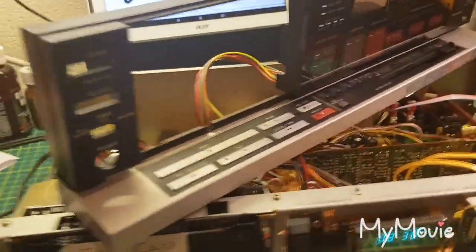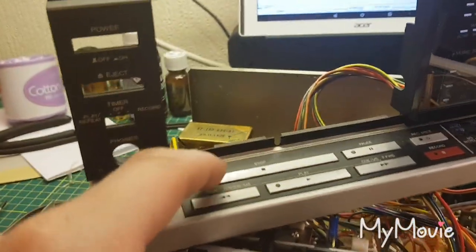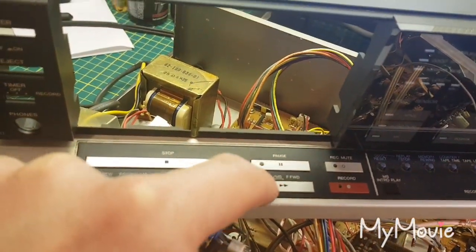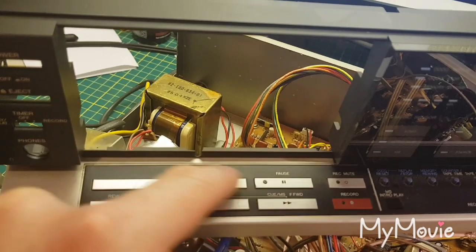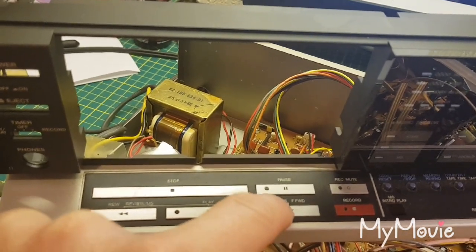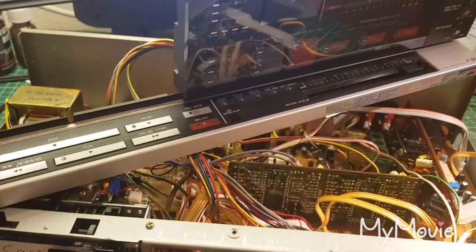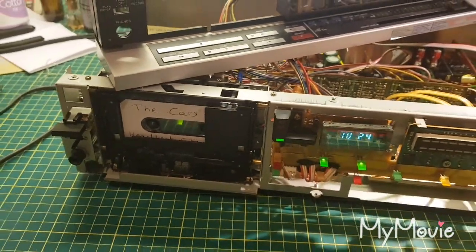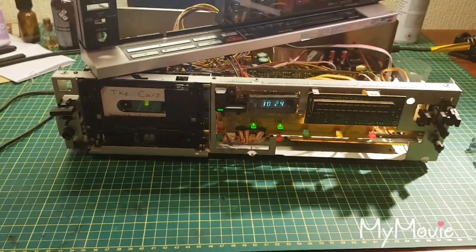The only thing I'm going to do is, once it's back together, remove the bottom panel there and look into these switches. I think the grease is probably dried up, because the fast forward doesn't pop up like the others. They've got a nice click, but it works, but it doesn't give you a nice click. So I think there's grease under there that's probably dried up. I'll re-grease the back of the capstan flywheels as well. So I'll be back when it's all back together. If you don't see this video, it means I've Donald Ducked it. Okay, see you soon. Bye bye.